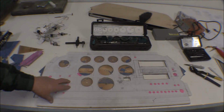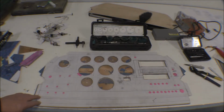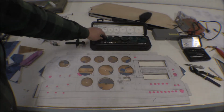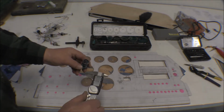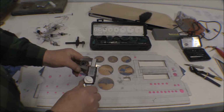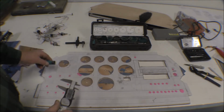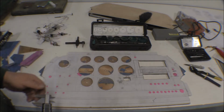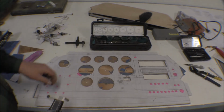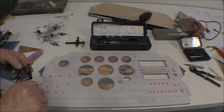After finding those templates online of the holes and the instructions on how to lay them out, I just went ahead and laid them out on here. And then of course I could have cut them out with a hole saw, but the hole saws are generally pipe size. Even one of these at 7/8, the hole is going to be bigger than 7/8. That's 55/64, pretty close to 7/8. I didn't measure this one before. But anyway, they make such a ratty hole. They always vibrate, they're not true round, and they make such a ratty hole that it could have worked. Of course, I do have a 2 1/4, but I don't have a 3 1/8.